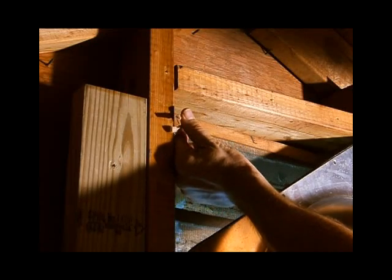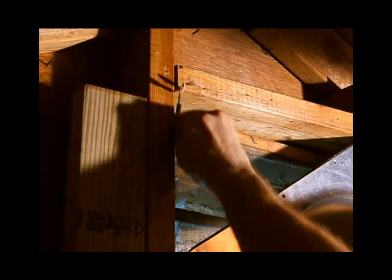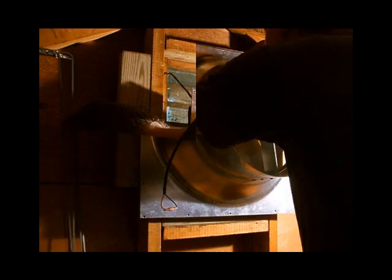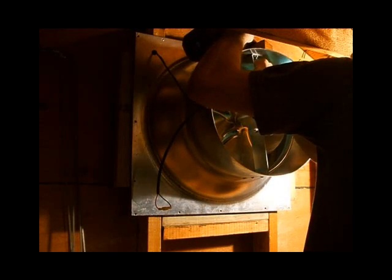All the supplied cables are terminated in spade clips with weather-resistant plastic covers. The cable just barely made it into the attic, but I preferred having the clip connections indoors rather than outdoors. Once you've dealt with the electrical cabling and you're satisfied with your framing, remove the protective strip from the sticky surface of the weather stripping and position the housing against the wood. There are wood screws supplied with the kit. Screw in the housing on all sides for a good seal against the wood framing.